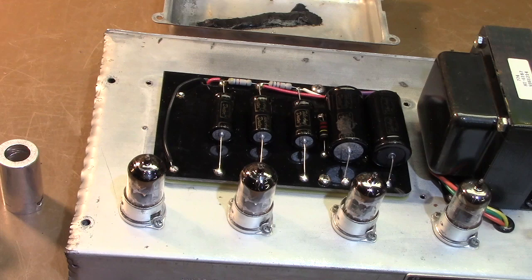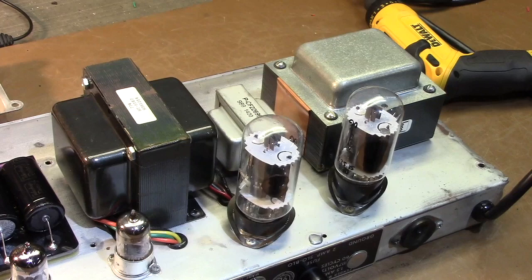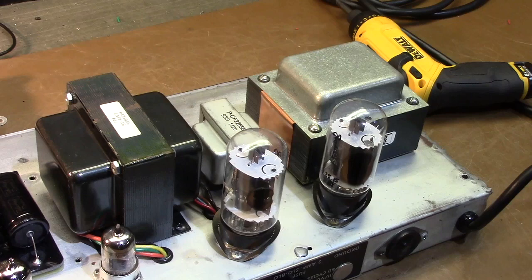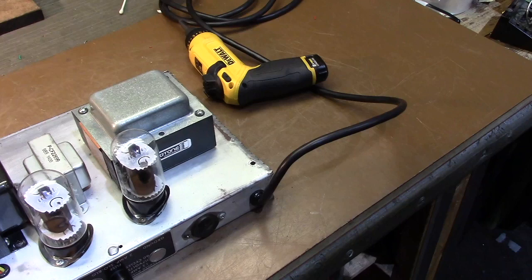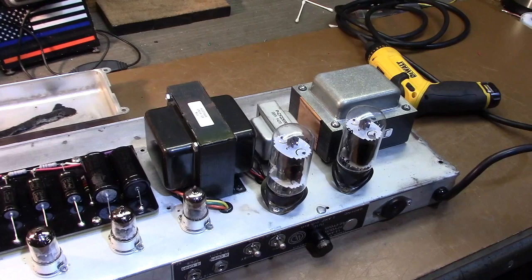So I started pawing through the circuit. The other transformers here are not original. I realized that the circuit I wanted was the AA-864, and that the AB165 was not going to give me what I wanted — a nice crunch in the bass channel and a nice Fender clean out of the normal channel, which is what the stock AA-864 will do. The power transformer is a Mojo Tone. The choke is just a Fender part, a more modern Fender part. And the output transformer is just a Fender Bassman transformer from a reissue.